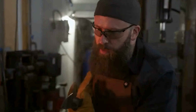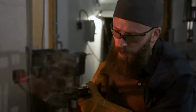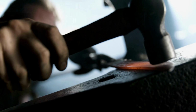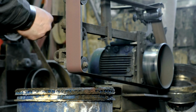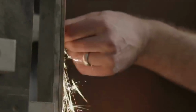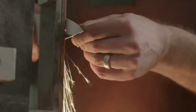The hardened blade seems to have weathered the process well, appearing straight with minimal warping. Correcting minor warps is feasible. Scale blown off the steel indicates successful contraction and hardening. Thus, it's primed for finish grinding and then handle attachment. The grinding step showcases paramount skill and substantially influences costs. A mere error can irreparably mar the piece.